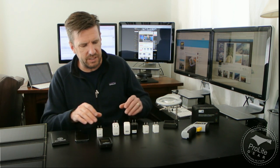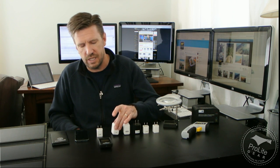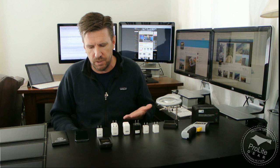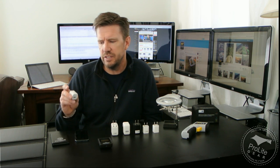So why is that? Let's look into what these devices are. Even though they're called chargers, I think a more accurate way to describe them is as a DC power supply. I'll put the specs in the article I write for this, showing the USB specs in terms of power output and wiring diagrams. We know that watts equals amps times volts, so this is a five watt device and this is a 10 watt device. But there's no charging circuitry included in these.